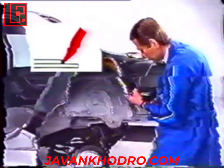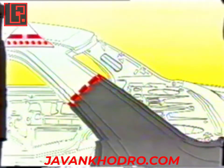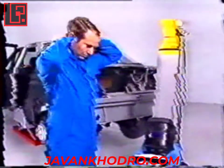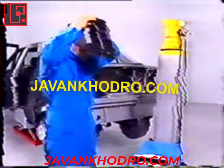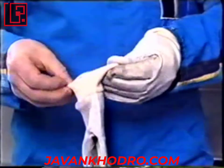Place a strip of structural glue on the wing skirt. The method uses these symbols to show how to weld the quarter panel using MIG arc welding. The MIG weld is made in a spacious and well-ventilated room, or one equipped with an extraction system. Thick and dry clothes prevent burns due to molten metal sparks. A cap fitted with special filtering goggles protects the eyes from ultraviolet rays. Contact lenses must not be worn under any circumstances. These ultraviolet rays can also attack the skin, and gloves must be worn.